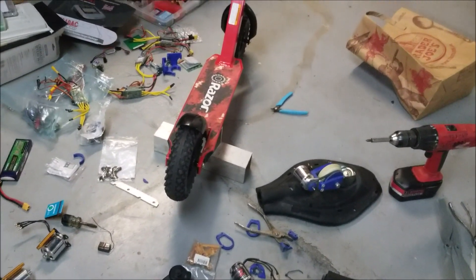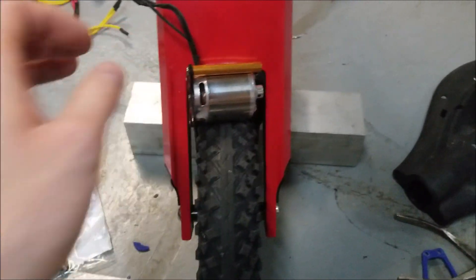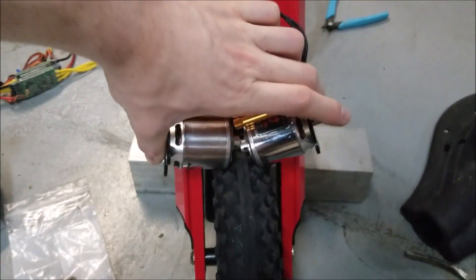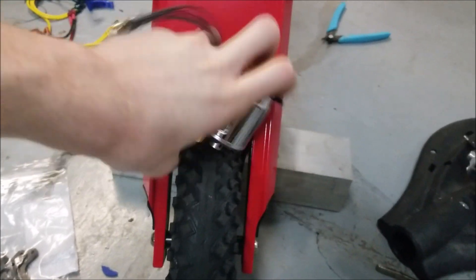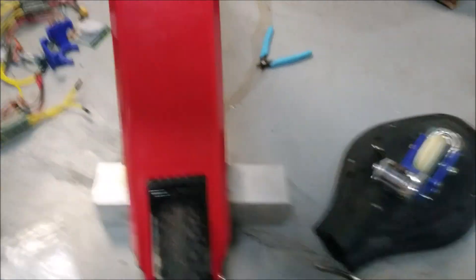The plan for mounting: I was originally thinking about just doing one motor with friction drive spring-loaded against the wheel, but I think it's going to be kind of weak, so I want to double that up. I'll couple the motors with a 3D printed part, press them against the wheel, and spring-load them in. Then I'll mount batteries, ESCs, and the receiver all along the frame so it looks really sleek — you might not even be able to tell it's electric.